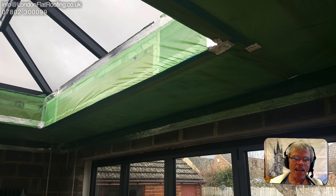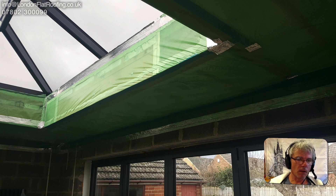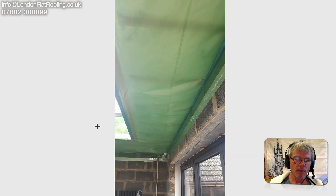You can just see the insulation underneath. He's taken the vapour barrier to the wall and taped it — this is airtight. You get more transfer of moisture through movement of air than you would from the vapour barrier itself. A vapour barrier helps control the movement of moisture — it will let some through — but a small hole, a light fitting or something that cuts through it, is going to let through a hundred times more vapour and moisture than a vapour barrier that is slightly imperfect. So don't get too hung up on vapour barriers.